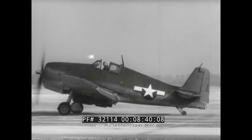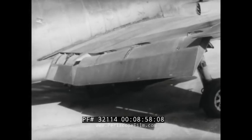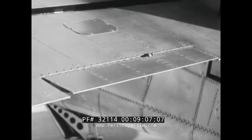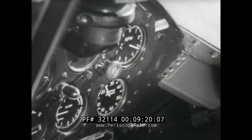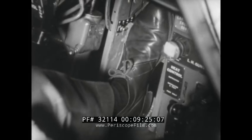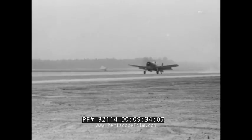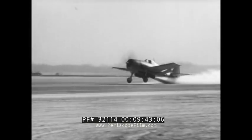In a land-based takeoff with little or no wind, the eight seconds of thrust may not be enough for the entire takeoff run, so you have to work it a bit differently. Pull flaps again. Set elevator tabs nose-down, same as before. Assist takeoff power switch on. Open her up till you've got full takeoff manifold pressure. Then release your brakes and start rolling. Wait two seconds, pull the trigger, and hold it down. Since you're already rolling, your rockets will last long enough to kick you upstairs.